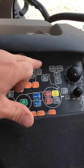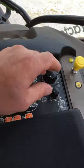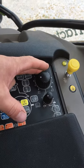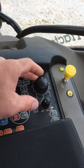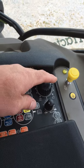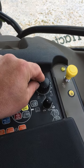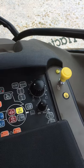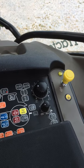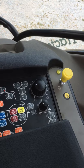The rest of the buttons here are not actually linked to the tractor. For fine adjustment when we're hitching up machinery, we have our lift control on this dial, so we can use this for hitching up to get a bit more precise control, and also to set height in work if we need the implement to stay at a certain height or adjust working depth.